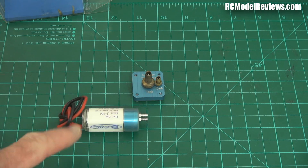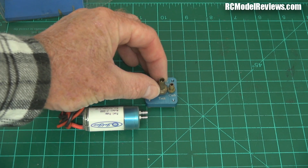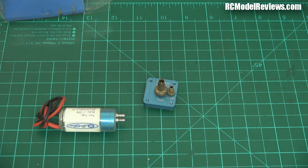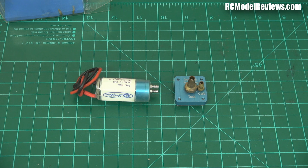Obviously there are some other things that need to be done — I'm going to have to drive this pump somehow, and I don't want the pump stalling. What will happen is that if the motor is just sitting there while we're trying to start it up, the pump will stall because it's trying to push fuel into a hole that isn't accepting it — it'll stall, draw lots of current, and probably burn out. So I'm going to make a little bypass system: a tube going to the regulator and a bypass sending fuel back into the tank, so we have pressure but if there's no flow it just recycles the fuel. This happens on car engines a lot — they have a pump constantly pushing pressure with a bypass going back into a reservoir. It'll be a bit of plumbing. The goal at this stage is not to produce something you'd want to duplicate — it'll just be proving that the pulse jet can power the model, the model flies okay, has enough power, and is controllable. Once proven, I'll refine the whole system and come up with something much simpler, cheaper, and easier to set up.